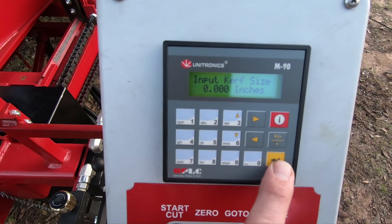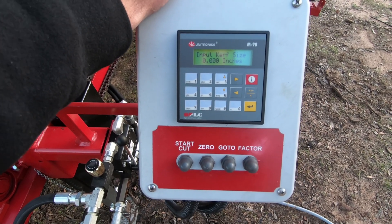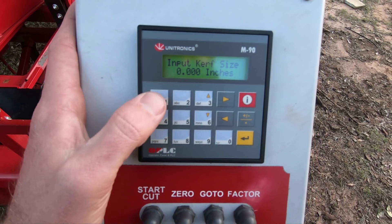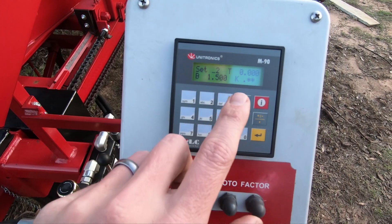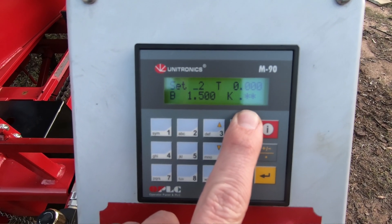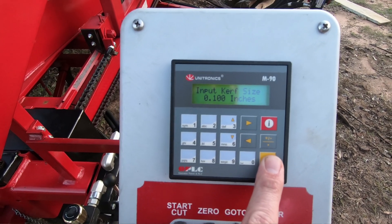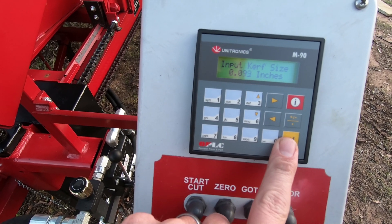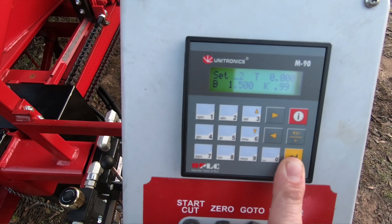The yellow enter button is going to ask us for our kerf — that is the thickness of the blade, and depending on the mill, that may vary a little bit. The blade on this mill is 55 thousandths with a 25 thousandths set up and 25 thousandths set down, so it gives us 100 thousandths. When I put in 100 thousandths — point one zero zero — the kerf is shown as an asterisk. It is there and it will work, but it shows up as an asterisk. A difference of one thousandth won't matter since we're sawing rough cut lumber. So if I go 0.099 on my kerf, that will show up readable, which just helps us visualize it.